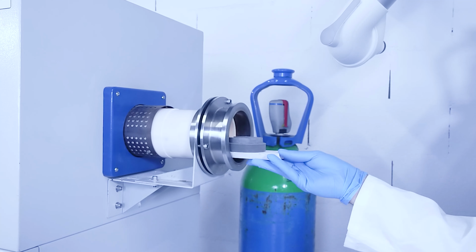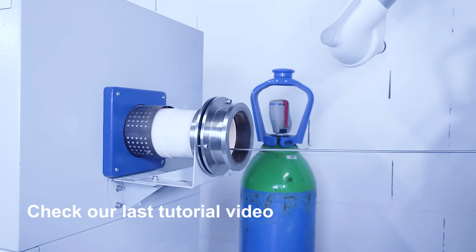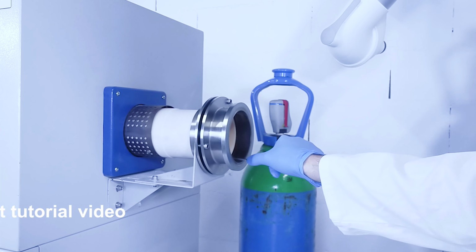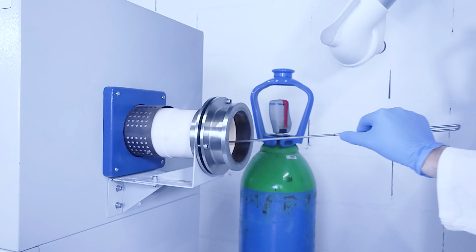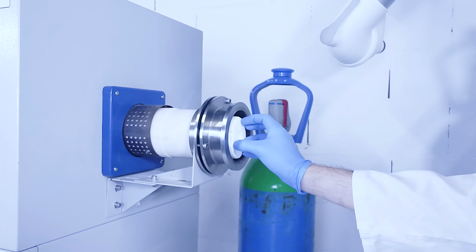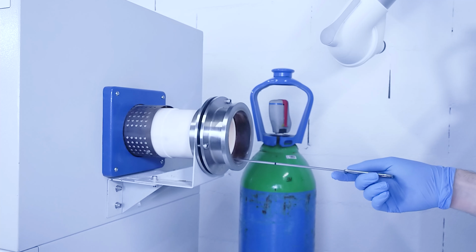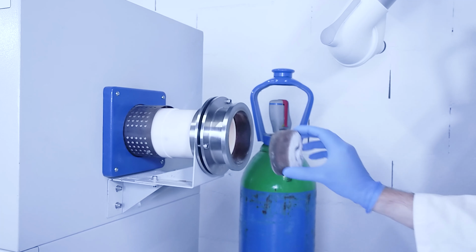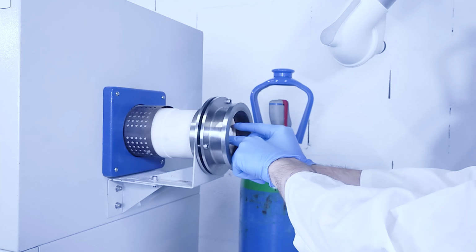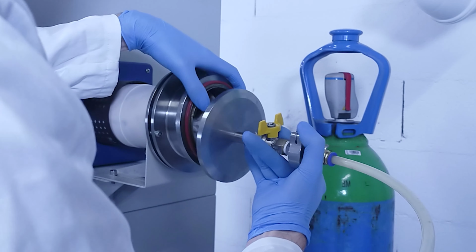Place your 3D printed metal part on a crucible and put it in the tube with the heat shield in the same way that you would for a ceramic part. Unlike ceramic parts, metal parts need to be sintered in a controlled atmosphere. Then, place the seal and the cover on the flange and place the clamping collar. Seal by tightening the clamp.